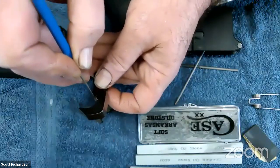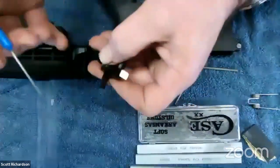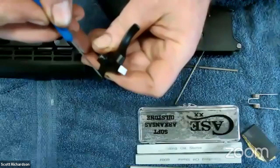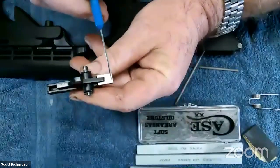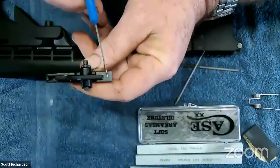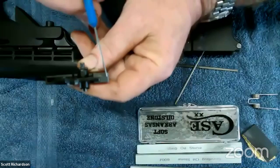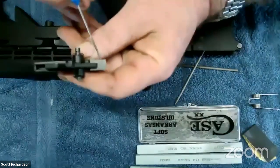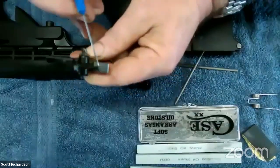I go to a really fine sandpaper and then a metal polish to do the best I can. We do not want to break or damage that edge. You can also polish the underside of the disconnector — polish those two surfaces without messing that edge up. The key thing about AR triggers is these are not fully hardened pieces — the whole piece is cast and the surfaces are just surface-hardened. So you can't remove a bunch of material or you'll work right through the hardening.